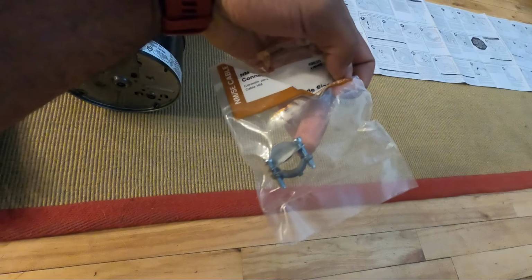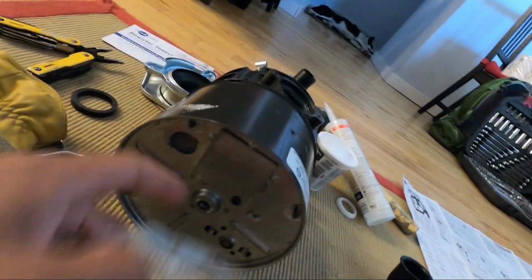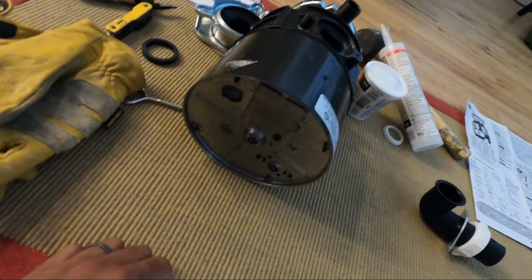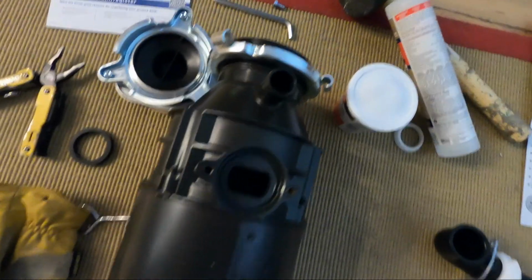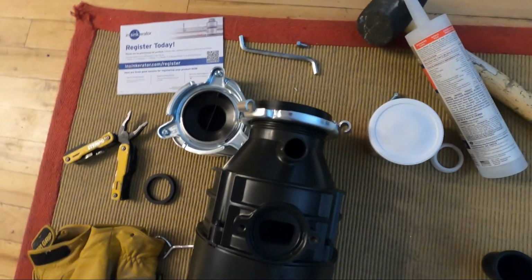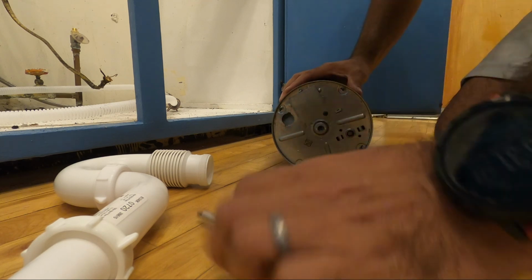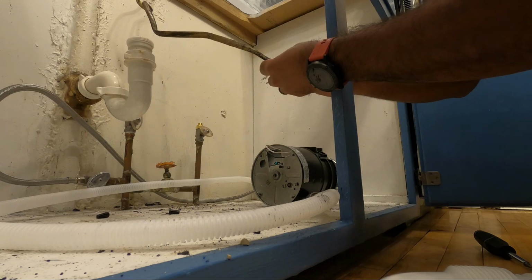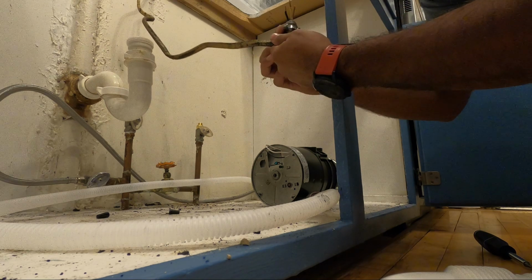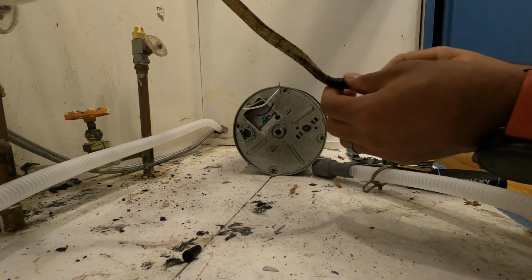Take this clamp style cable connector, screw it into the bottom right here, open this plate up, find the 3 wires, 2 wires in the ground, and then it should be good to go. Already knocked out the dishwasher attachment point, so plastic's out of that, it won't rattle around. These wires actually need to be stripped a little bit more.